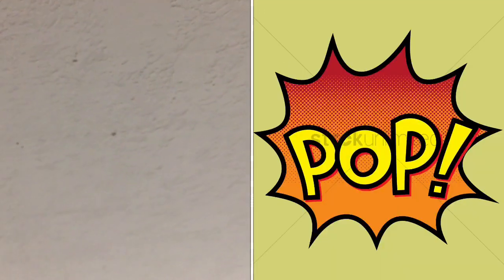Here's the ceiling — I went with a standard heavy knockdown texture up here because I wanted it to really pop. My wife is going to paint it a darker color. The hardest part about doing the drywall in here was that there are no real corners — all the edges had to be cut and customized because we're not dealing with squares and rectangles. This is an amorphous shape, so that was a little tricky. You can also see the lime plaster touch-up where the walls meet the ceiling.